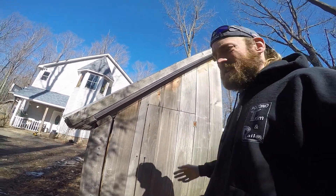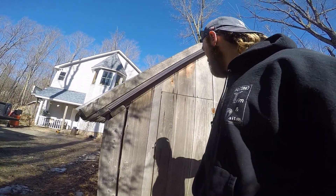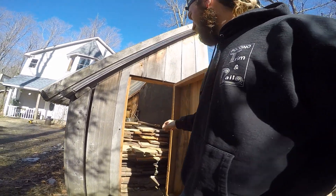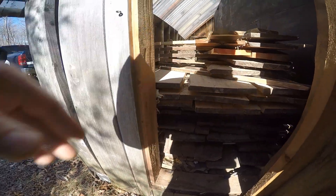In designing this kiln, I followed a couple ideas and practices. The angle and the size — five feet wide. I made this 18 feet long for a reason, and I put doors on both ends so you can get in there. You can see this is quite the pile of wood, all stacked across there, stickered and ready to go.